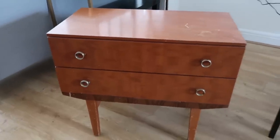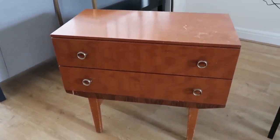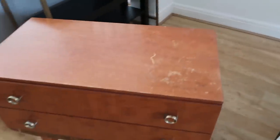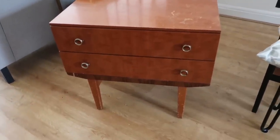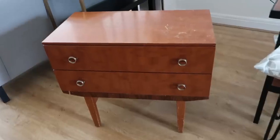One of the first things I'm going to do is give the whole thing a clean because it's a little bit dusty in places. I do want to try and keep areas wood but they are quite damaged. I'm going to sand the whole thing back, take all that varnish off, sand it right down to get all this horrid orange-y varnish off and see what the unit is like underneath.